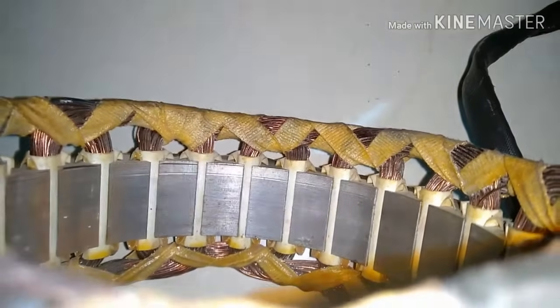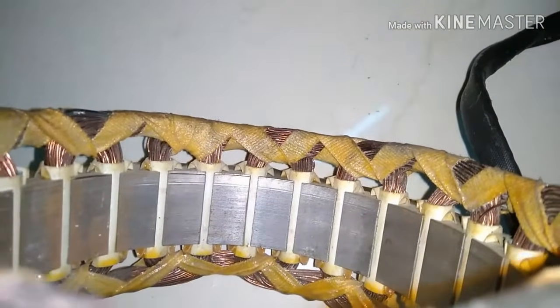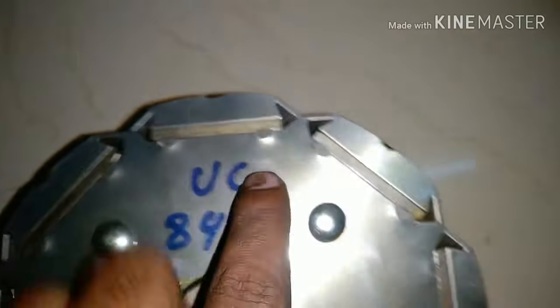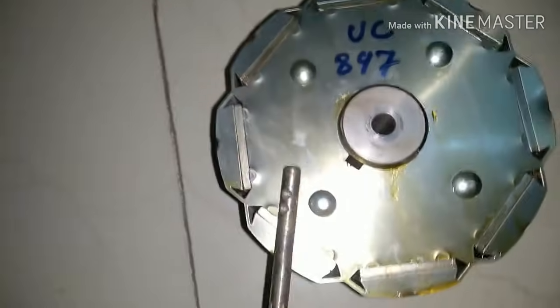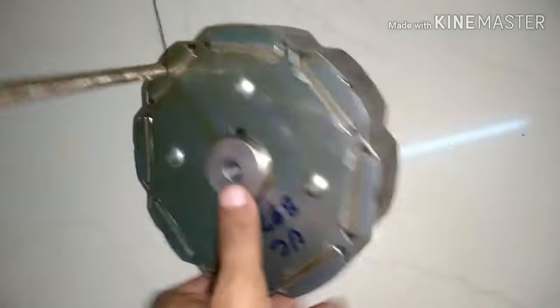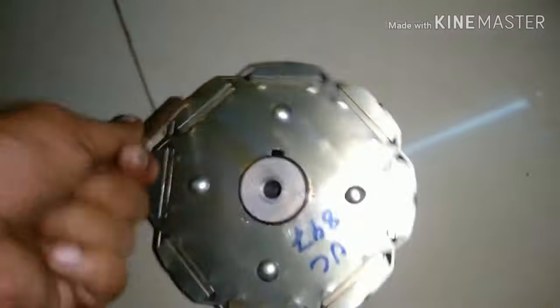PMG's output is given to P2, P3, P4 leads. Now talking about PMG's rotor, or its magnetic rotor — the rotor is made up of laminated core and mild steel. The main difference in PMG's rotor construction are the magnetic strips inserted inside its metal body. These magnets form its poles. These magnetic poles, when rotated inside the wound stator, generate voltage across P2, P3, and P4 leads. These leads are then connected to our AVR.